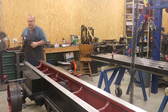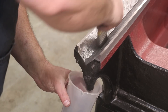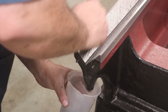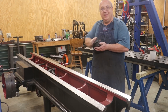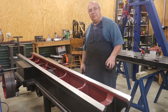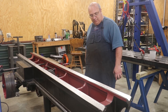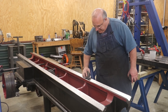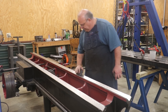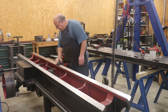Got another pile of cast iron shavings here. No real reason to keep these — I'm just curious as to how much metal we scrape out. That was some work, but we got the first round of blind scraping done. I've got a crosshatch pattern in here now. I feel comfortable going ahead and bluing this thing up so we can really start working and seeing what we need to do to straighten this out. Next step before I do that though, I want to stone these — I want to take out any burrs put in there from the scraping. It always raises up a little burr, and I'm using my precision ground flat stones for this.